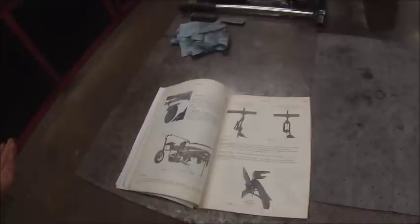They've also been called trash boards, and in the book, they actually refer to them as a moldboard joiner. I've never actually heard them referred to like that other than in this book. Now, what you can use in place of these, because they actually increase draft, they make the plow pull a little harder. It's not really noticeable, but if you're in a situation where you're right on the horsepower limit, they make a plow pull harder.